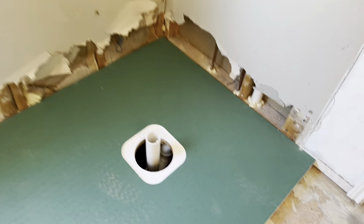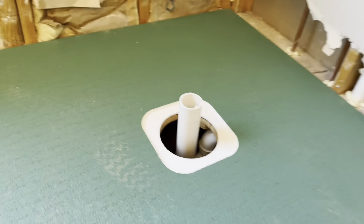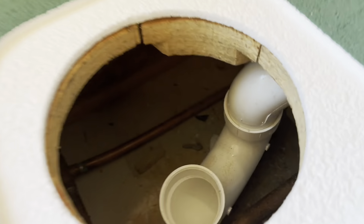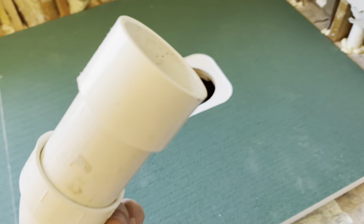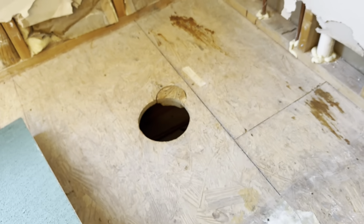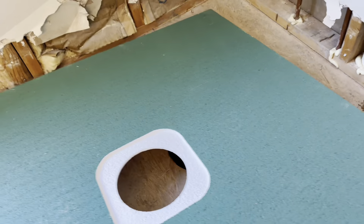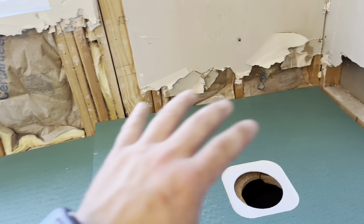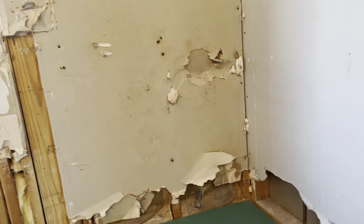As you can see here, we now have the pipe moved to where it's supposed to be - it's just dry fit right now, but we got this that we're gonna glue together and get connected onto that old pipe in there. I got the hole cut perfect with that little block put in. It's probably overkill, but I'd rather overkill than underkill it.